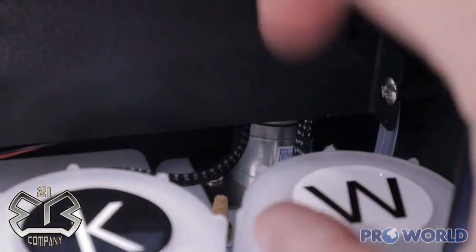The fact that we do have a built-in stirring system for our white to keep it from separating. Definitely, that is a key feature that you do need to have. That's one of the leading causes of people having issues with their whites, is because it separates. And when you're using these EcoTank printers that have been modified, it's very hard to be able to stir up those inks and to keep them going, unless you're printing on a daily basis, every single day nonstop, to keep that ink circulated. Even then, you're gonna run into some problems. So having the ability to have that system in place is what DTF is all about, and that is why it is implemented, because the white ink is what gives you the most problems. If it's not maintained properly and circulated, it'll separate, the white from the yellow. So definitely having that is key.